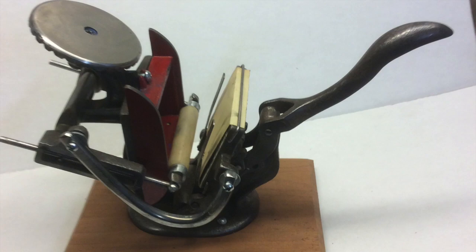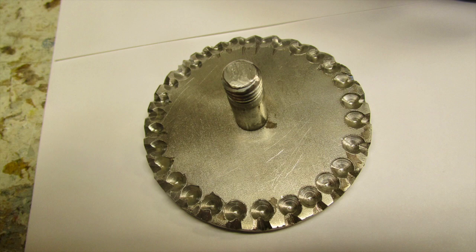It's a three inch disc, quarter inch thick. Since I don't have access to a welding facility or a metal lathe, I had to attach it to the shaft by drilling a hole, threading it, and putting in a flat headed screw. I then screwed it to a piece of three quarter inch pine and clamped that to my drill press so I could turn it and always have the holes drilled in a uniform manner. Those holes represent the teeth which would normally have been cast on the back of the platen to activate it and cause it to turn every time the print lever was depressed.